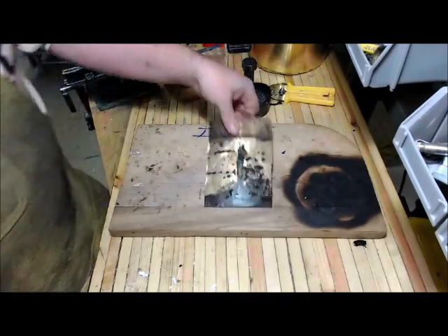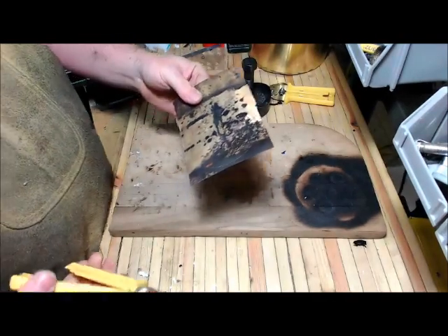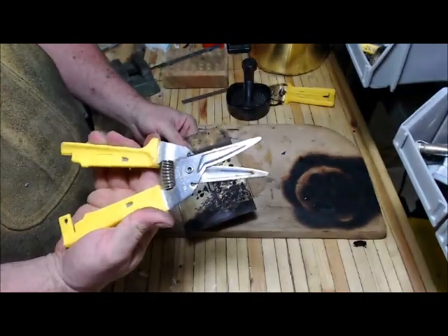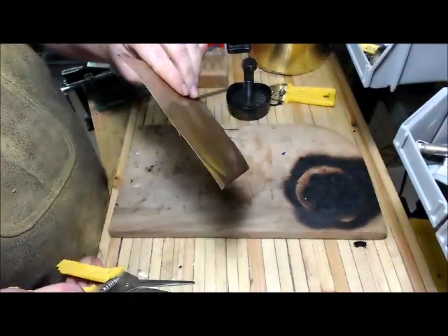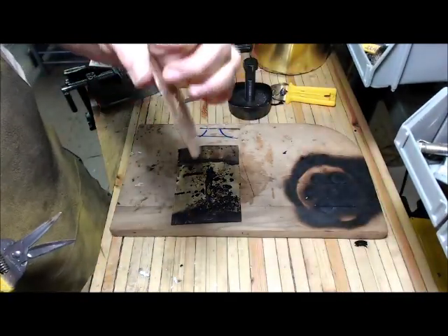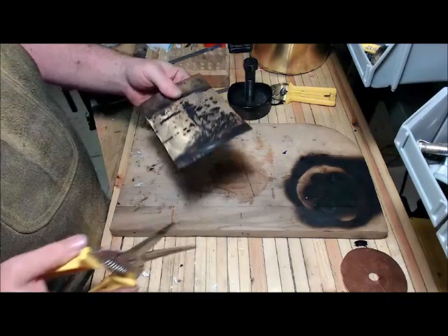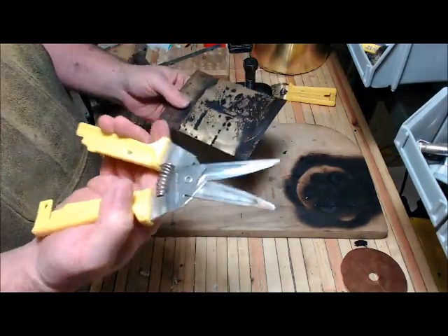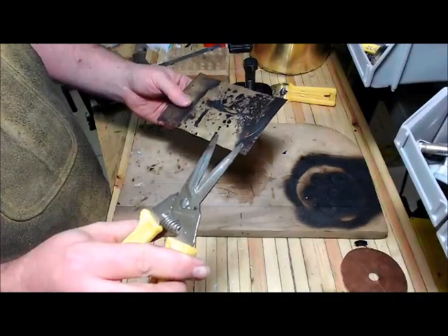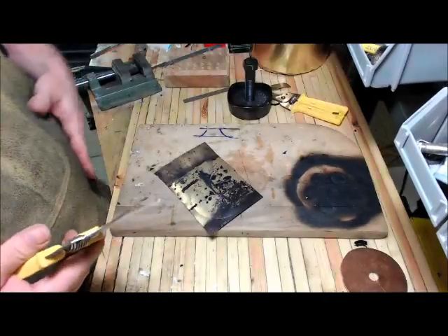Now you've got a circle marked out three times — time to cut them out. Almost all the sheet metal work I do, I do with these snips right here. This metal is very thin, but even heavy-gauge copper plate, these do the job. I'm not sure where to get replacements — I keep my eyes open. Cutting it is just like cutting heavy card stock, though a little more likely to create a metal sliver.